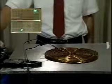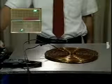Its density is 2.7 grams per cubic centimeter, so that for a given current and thus magnetic force, the coil will rise higher than if made of copper. Although copper is a better conductor by a factor of about 1.6, its density is about 3.3 times greater than aluminum.